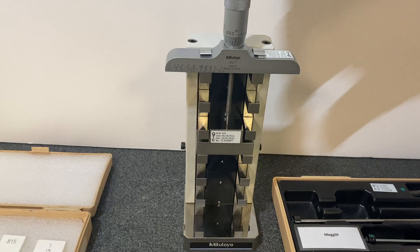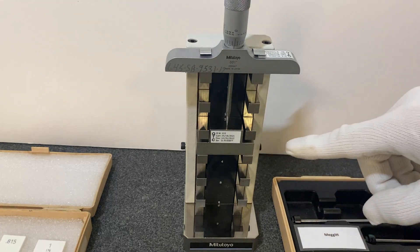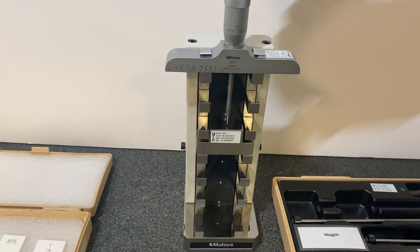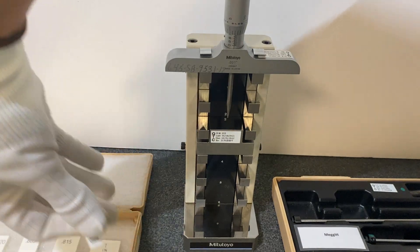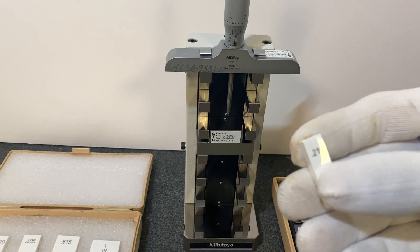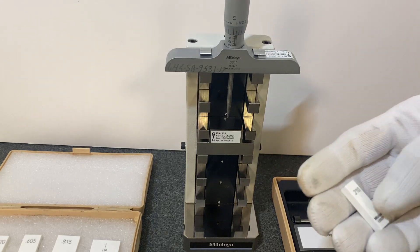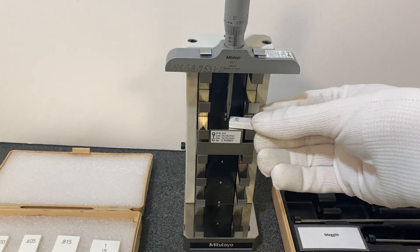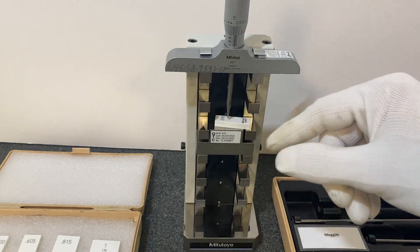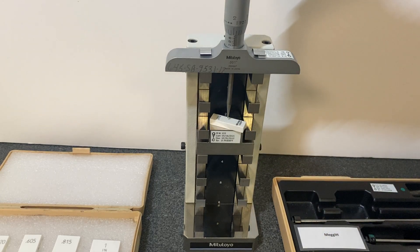It's looking pretty good. That's actually the full one inch extension and we will begin to retract from here. We're going to use these gauge blocks — these are the same ones we usually use for most micrometer sets, with the numbers corresponding to rotations on the mic head. The first block we use is a 210. Since it's a full one inch extension, 1000 subtracted from 210 is 790. So the value we're expecting is 790.